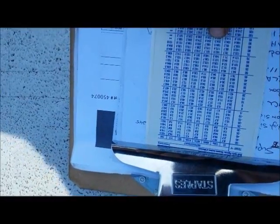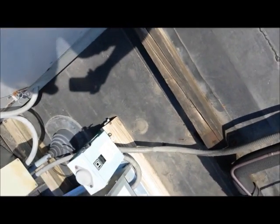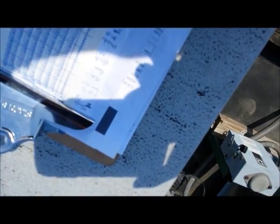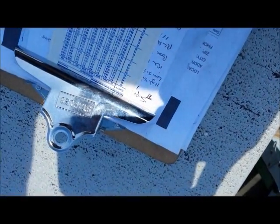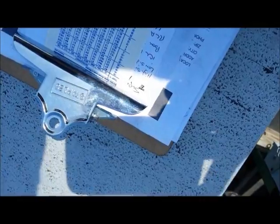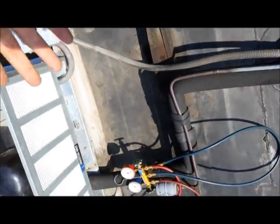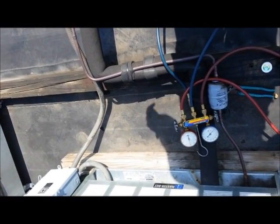For 404A, we should be running at 204 pounds, so anywhere from 180 to 204 is what I'm looking for. I take the temperature of the day at 30, go to my pressure relationship chart, find the temperature, find the gas. So roughly, I'm running high head by about 50 pounds — high head, low suction, no bubbles in the sight glass.